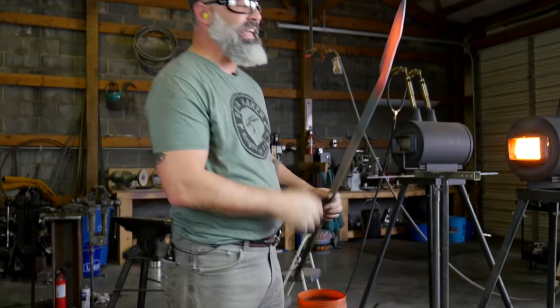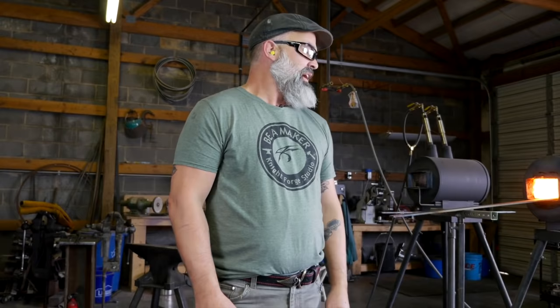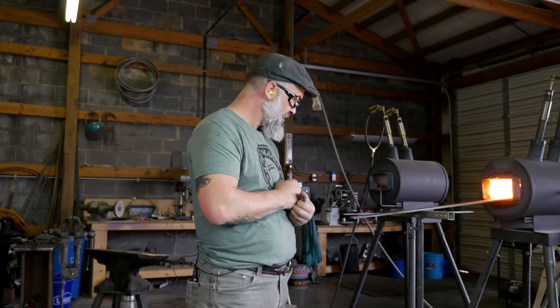When you start running out of heat, get it hot again. One of the neat things about the 80CRV2 is you can forge it down to those dull red colors. You're not really moving steel when you get down there, so don't go too far. But when you start doing your finishing and your planishing, you can forge it into the black heat — that doesn't make it magic, that just makes it smooth. This steel responds well to that. It has a fairly high vanadium content — makes it very tough, very wear-resistant, and very fine-grained.